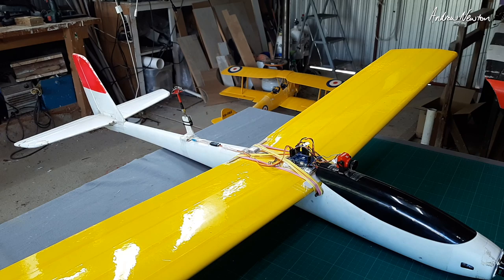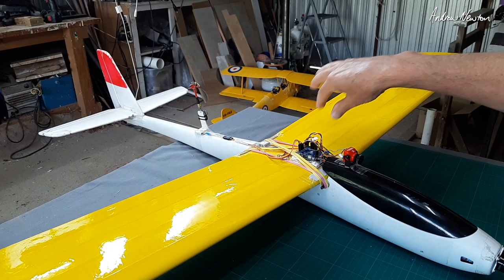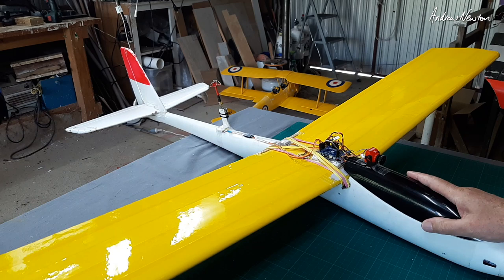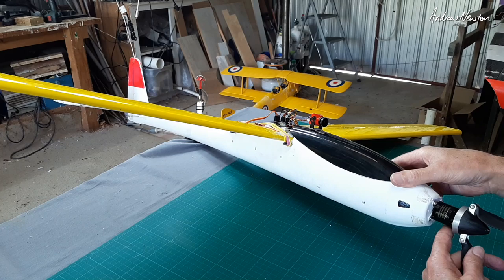I've made up this dihedral wing just from folded 5mm Depron. I've got two arrow shafts joined by an aluminium joiner with a little bit of a bend in the middle to hold the dihedral. I have a Matec F405 wing board. This is an old Phoenix fuselage version one — the one I have the ASW wing mounted on for a slope soarer. I've put a motor on the front: a Sunny Sky 2212 980KV with a 10 by 6 prop.